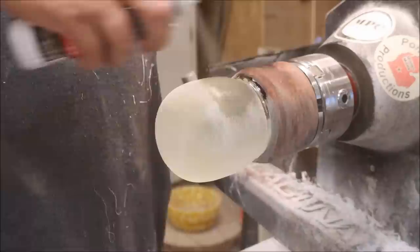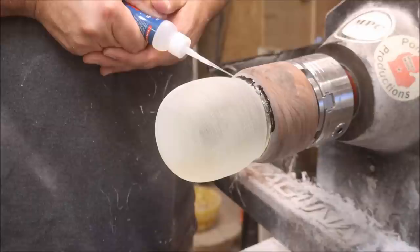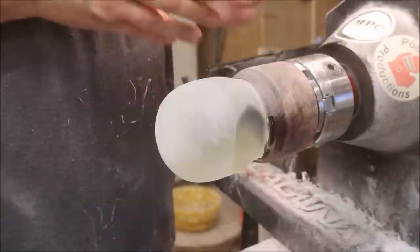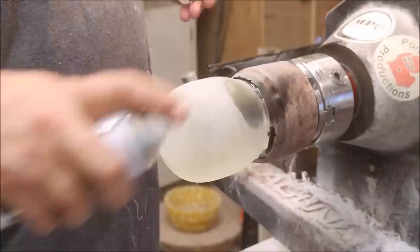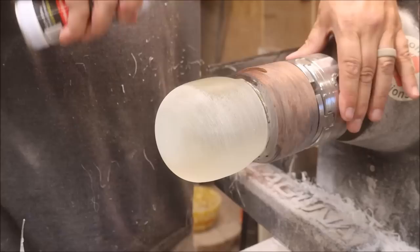All right, so there's cracks in here because I didn't seal this wood like I should have, and now there's cracks down here where the air didn't want to let the wood and the resin contact. It's about totally disconnected here. That's scary.